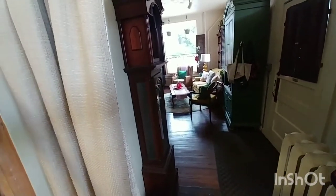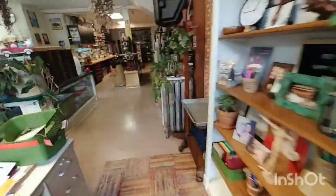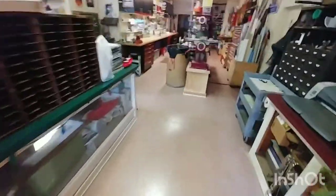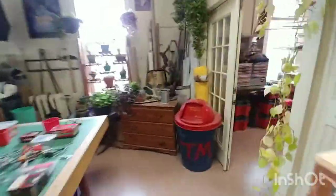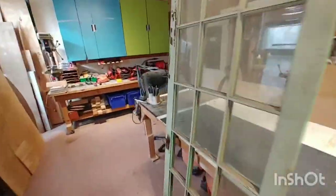We need a real door here. It's a 32-inch opening. It's for a 32-inch door, so it measures out 34. I think we're at 32 and a little bit now with the inch and a half on it from the jamb. But I'm trying to do this on the cheap. I could go out and buy a secondhand interior, and I'd like a full light door, just because if we're going to do it temporary, I don't want to fully phone it in.